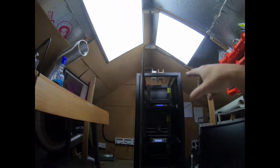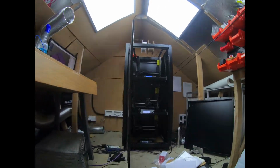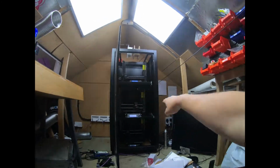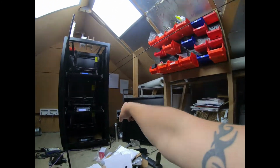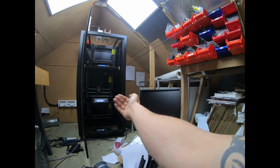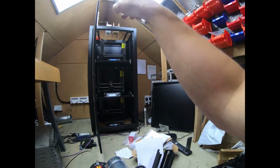So guys, this morning, which is Bank Holiday Monday, I have started on the extraction. I'm using Airflow's 125mm fans. I really like Airflow fans. They're quite low noise, they're good extraction rates, they're low wattage. When I used to fit fans domestically in customers' properties, they were very reliable, so I like them.